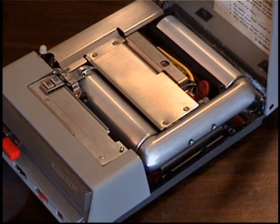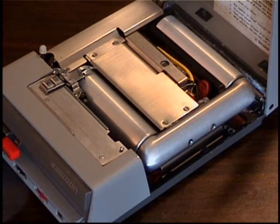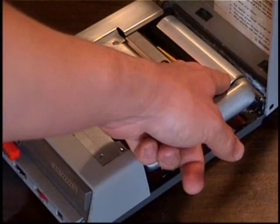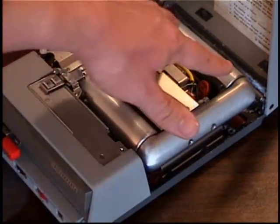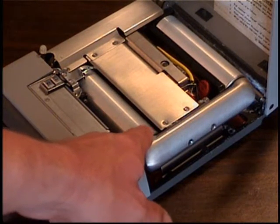Whenever I first acquired this machine on eBay, to my surprise, the device actually managed to operate off of the original cells after receiving a charge from the charger. Although the old cells could hold a charge, they were not able to supply sufficient current for the machine to operate at a high enough voltage without tripping the dead battery alarm, which was emitting an annoying buzz. So, I've since put some new nickel metal hydride smaller batteries inside just this cylinder and rewired it so the power is taken off of only this cylinder. I left the old batteries inside this cylinder partially so that there'll still be some weight to the cylinder.